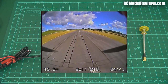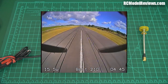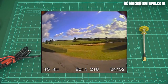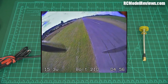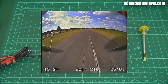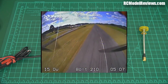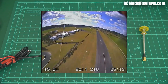We get reflected signals off the hangars hitting the antenna on the receiver, so flickering here is an indication of multipathing or poor axial ratio — and it's pretty damn good. There's the occasional flicker. We're in the Fresnel zone. Now we're coming on for 450 meters in the other direction. When I fly back, I'm going to fly over the video recorder and over the antenna on the receiver — directly over the top — so we're going to expose both antennas end-on. We should see a null, a lot of snow, as I fly directly overhead.